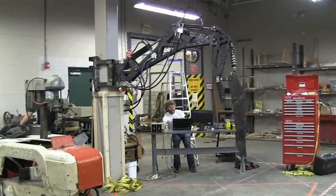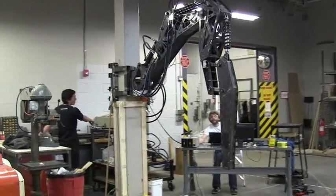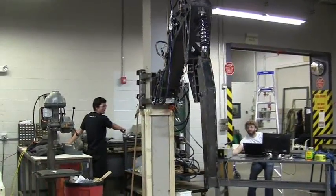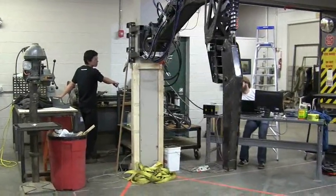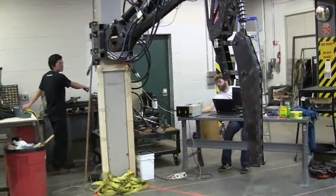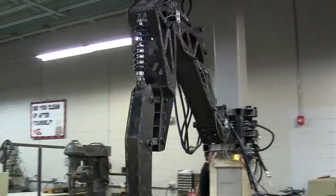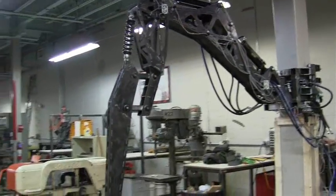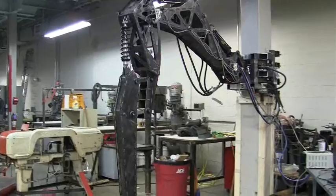In this case we were able to get a leg up, as it were, by using our simulation that has physical modeling in it to tell us about what we needed. It worked out fairly well. The leg's still a little bit shaky, but that's going to be a lot of tuning over the next couple of weeks. We are pretty happy that we could just start the leg software up for the first time, use gains from the simulation, and be close to right — not perfect, but close to right.